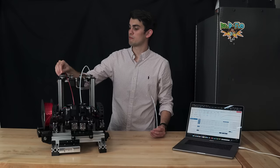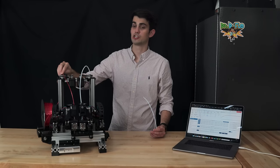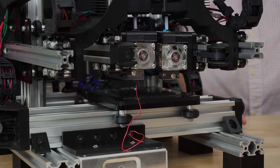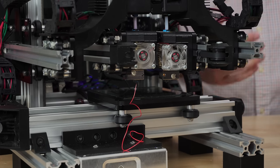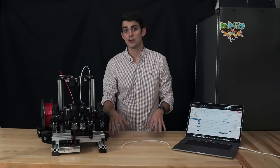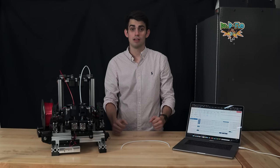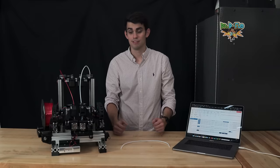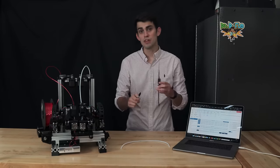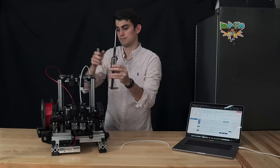It prevents the filament from getting caught in any of these moving parts, which would cause it to snap. Accurate extrusion of the filament is very important for print quality. To make sure that the extrusion drive is pushing out the right amount of filament, we will double check that when instructed to extrude 100 millimeters of filament, 100 millimeters of filament is extruded. I typically use a Sharpie to mark the filament 100 millimeters above the cold end.